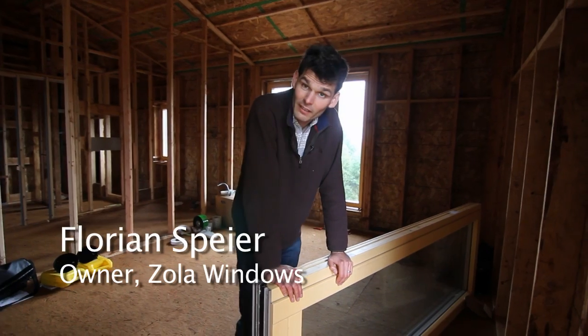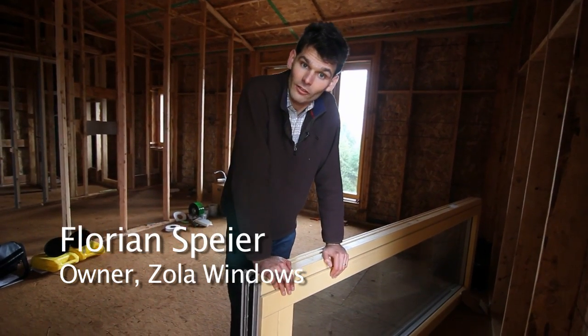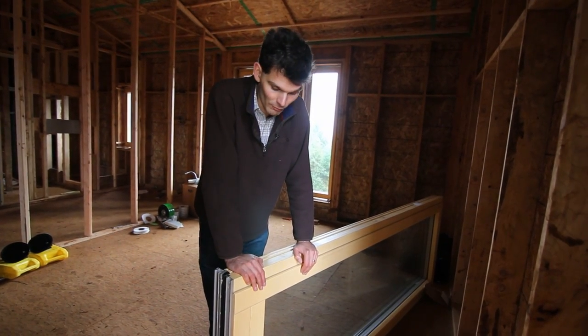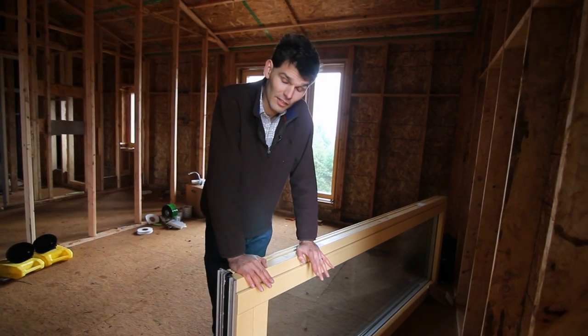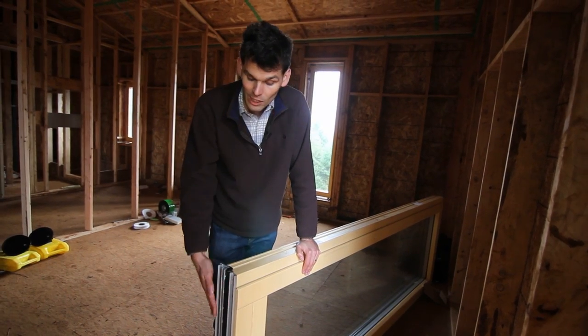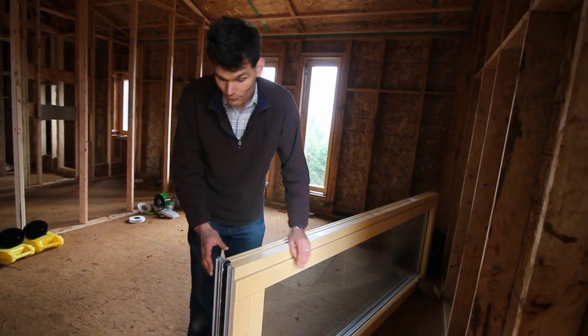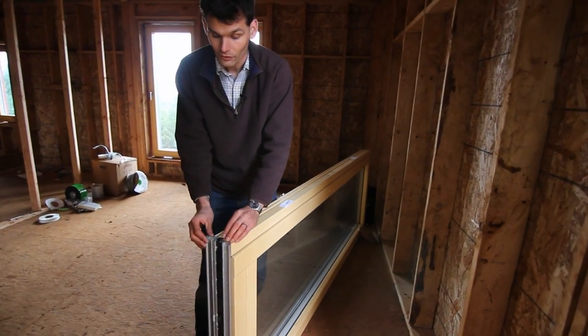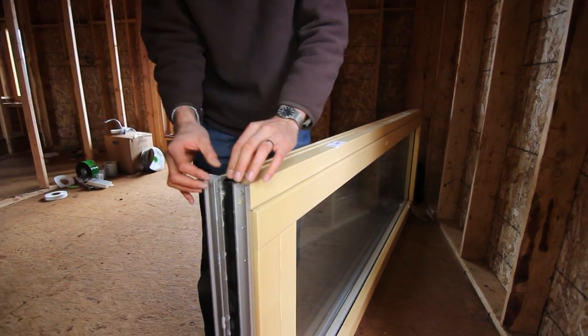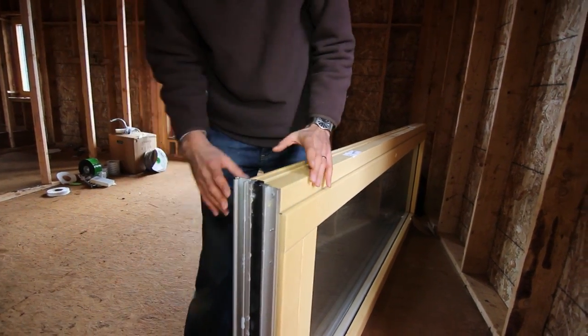This unit here is a so-called balcony door. A balcony door is the most economical of doors and is very practical, especially for bedrooms. In a way, it's nothing else than a big tilt and turn window with a low profile aluminum threshold. The threshold itself is thermally broken by having a fiberglass PU piece in the middle, so it has pretty good performance.